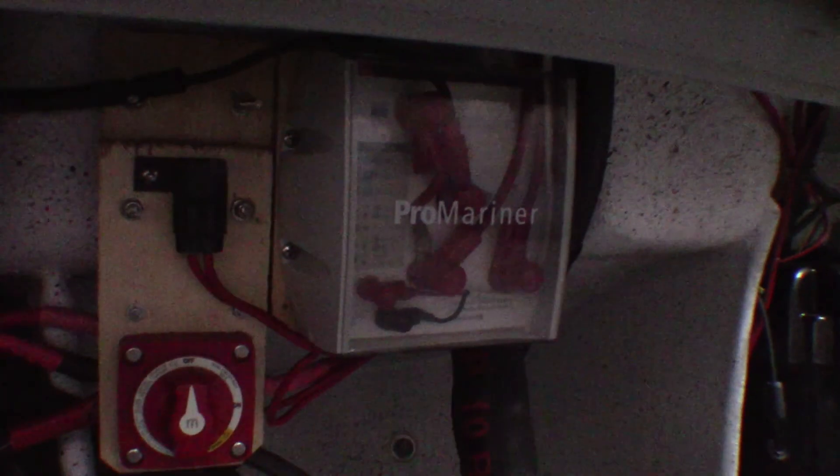The house battery is around 550 CCA — probably around 80 amp hours — and the trolling motor batteries are 130 to 140 amp hours, so they'll last a lot longer. I have three banks of batteries and an electrical system that will make sure they're all charged in the most important order. I love the peace of mind that gives me out on the water. Thanks for taking the time to watch this video — I hope you got something out of it. I'll put some links in the description for all the bits and pieces I used. Don't forget to click like, comment and subscribe. Until next time, good fishing.